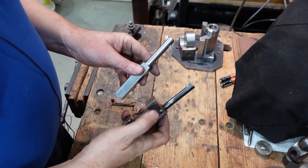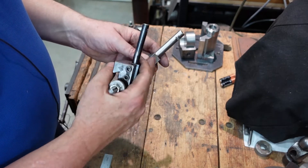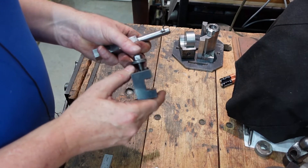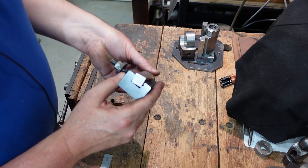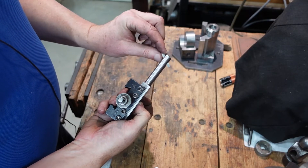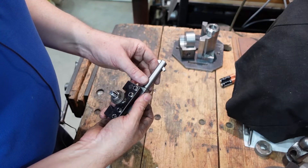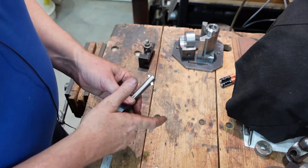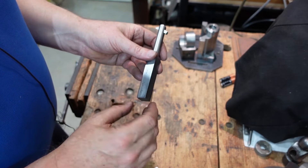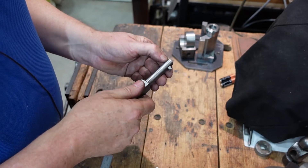So why is this better than this? A couple of things. First of all, the square shaft on there means that I don't have to worry about a clamping block. And if I have a holder with a V in the bottom, I don't have to worry about it moving around the place — that's just solid. The majority of my threads I cut are less than this into a part, so I can make that a fixed length. There's nothing stopping you from making that round and using it that way, but the square certainly gives me rigidity and resistance to twist.